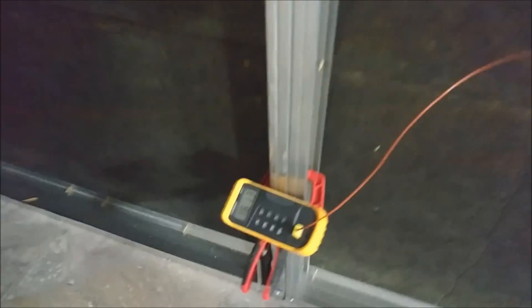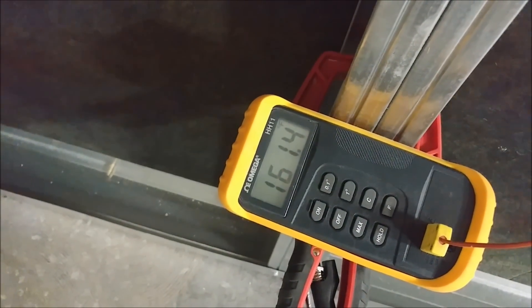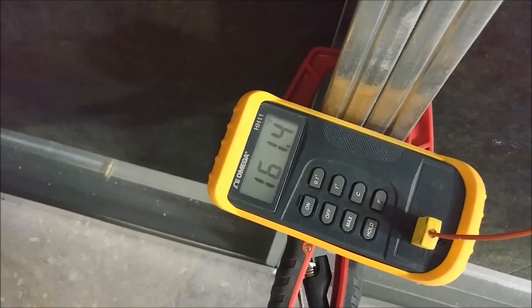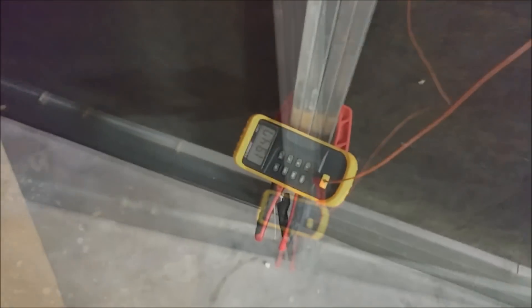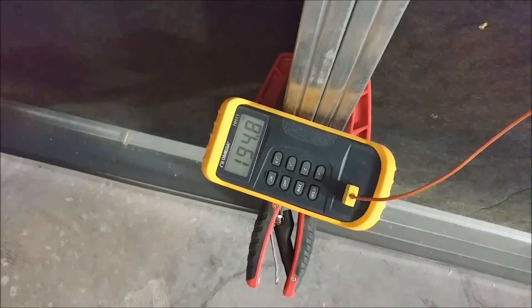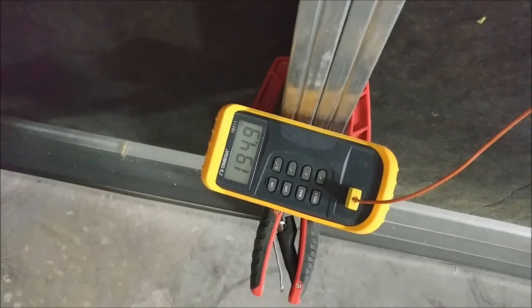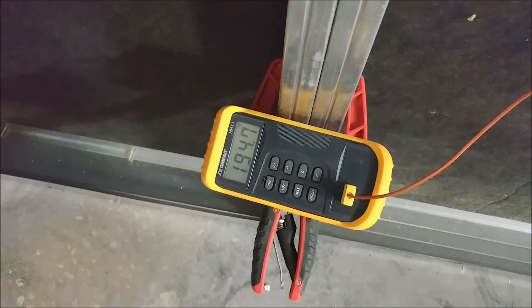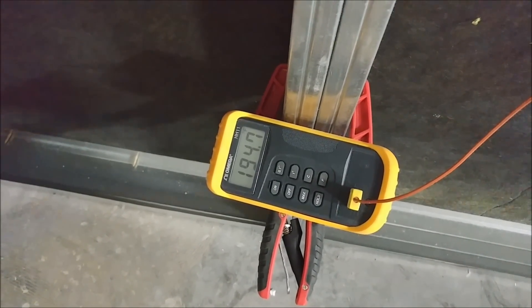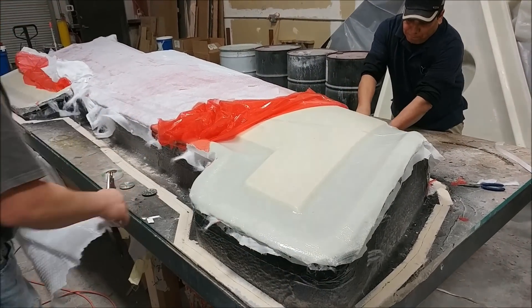We have a thermostat with a thermocouple poking through the wall. As you can see, we hit 161 degrees — the goal is to get to 180 and comfortably run that for 10 to 15 hours. We kept going, and ultimately got to 195 degrees, then had to turn it off because the fan blade was a bit wobbly in the test setup. But mission accomplished — we're getting the temperatures we wanted. Super happy, though we still need to make some more tweaks to the whole setup.